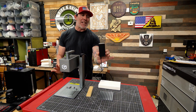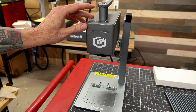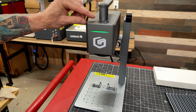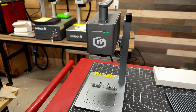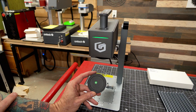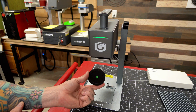Now that we have the power supply attached, let's go ahead and plug this thing in and power up the unit to make sure everything's working correctly. This is going to be the main power switch — let's go ahead and engage that. I just heard the fans kick on and now we've got the green light illuminated. Up on the top side you're going to notice a little red target-looking indicator. Press that one time and that brings up our two little red dots, and that is how we set this in autofocus or we can simply use the supplied ruler. This is already set to the factory focal height. And if you are not seeing your red indicator lights, don't forget on these Galvo head lasers they do have a lens cover on the bottom — make sure you remove that.